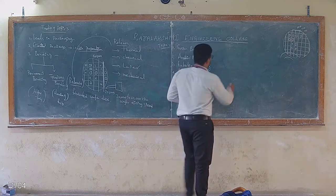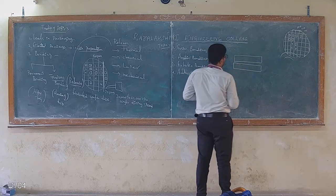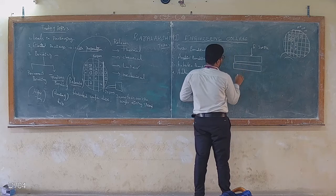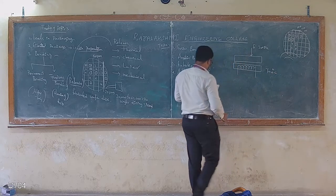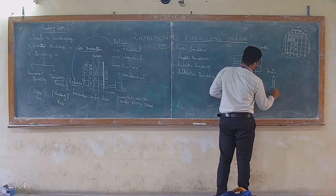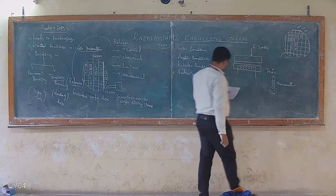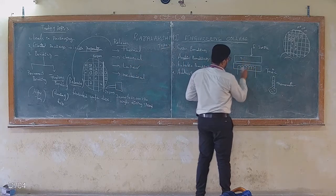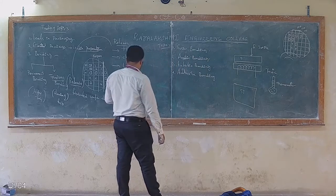What is fusion bonding? In fusion bonding, we are taking care of two single pieces that are very thin by nature. I'm going to apply a mechanical force of 3 megapascal, and I'm going to maintain the temperature at around 700 degrees Celsius. By electrical heating I'm going to get the temperature, and by thermometer I could understand it is 700. This is called fusion bonding. Fusion bonding is nothing but joining silicon with silicon. After this, these two become a single piece of silicon. It's called fusion bonding.